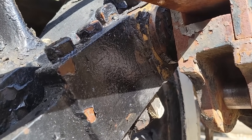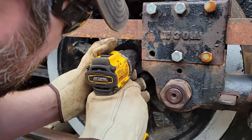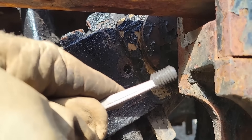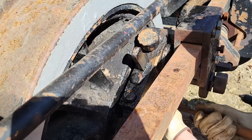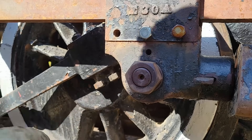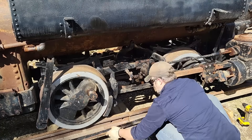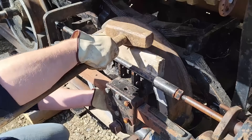I'm not going to go into detail about dropping the side rods right now, but if you'd like a step-by-step explanation, pause the video here and go back and check out episode 11. For everyone else who's done this with me before, did you notice the interesting difference between the two locomotives' rods? Specifically the bearing wedges. It's really fun to see little differences between two essentially identical locomotives manufactured only six years apart. I'm using a small hammer because it's less likely to hurt something but will still mostly get the job done. Whatever the little hammer can't do, the sledgehammer and a block of wood certainly can.